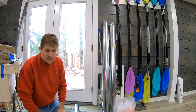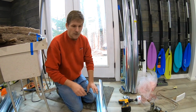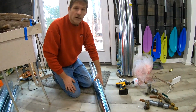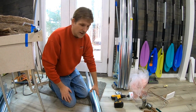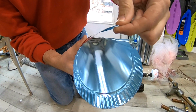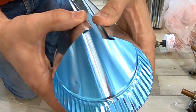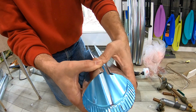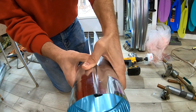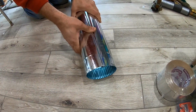We're not using the flexible ductwork, the plastic flexible. They all have major drawbacks. So the thing is to use this rigid ductwork to run from the dryer all the way to outside. Basically, there's a female clip portion that goes there, and the male edge goes here. We're just going to put those together, and you put them together by basically squeezing down till that pops into that hole. And once you get started, you just push this together and down in the middle and together from the sides and work your way down the pipe.